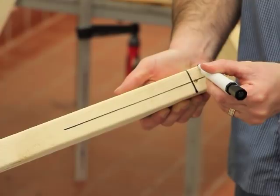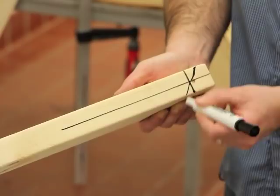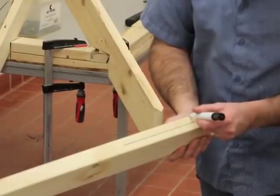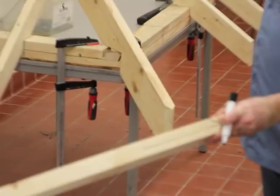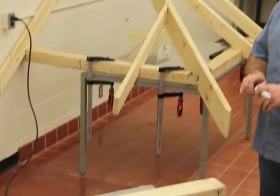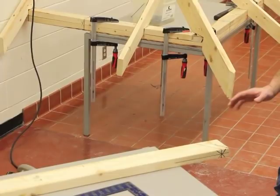If I cut with my skill saw set to a 45-degree bevel cutting down this way, I'll create a jack for the left side of the hip looking up the roof. If I come three quarters of an inch down this way and cut back up, I'll create a jack for the right side of the hip. You could do a double cut and have jacks good for both sides, but the craftsman in you should want to do a single cheek cut — it fits a lot nicer, gives you more to nail to, more meat, and it looks better.